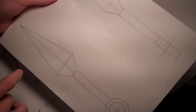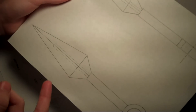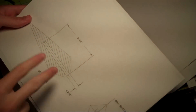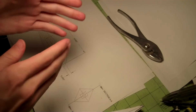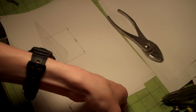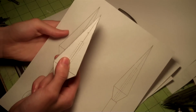This is the biggest one I have. You can see the area that needs to be cut out right here — it's represented by these dashed lines, which are called hidden lines. You're not technically supposed to dimension anything off of hidden lines, which is why I created a separate section view to show these dimensions. Basically, a section view is where you imagine cutting an object in a certain direction so you are able to see the inside and measurements that you wouldn't be able to see from an outside view.